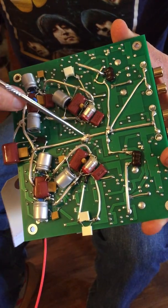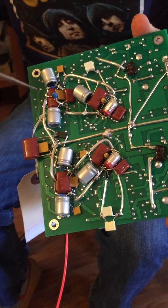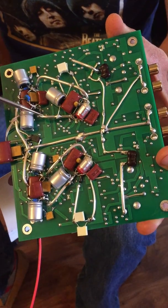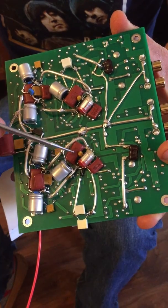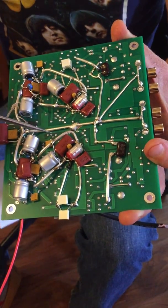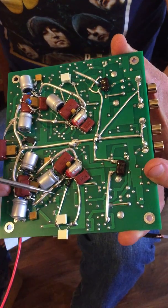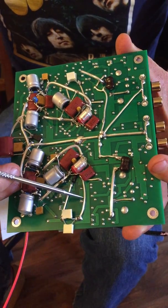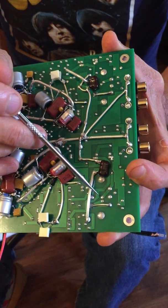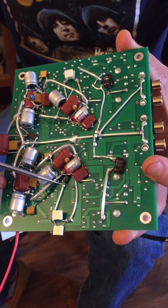You'll also see the silver wire — a big piece of bus wire for the main ground, and also for grounding of the raw filtering components. For the regulated power supply, you have silver wire for the feed that gets power to the op amp. For the audio section, there is silver wire for ground and power supply, and for the high frequency network there's wire here as well, plus a small jumper relating to the inductor.